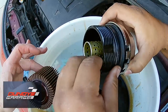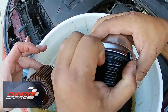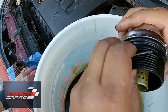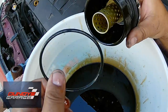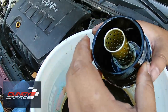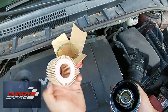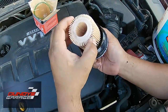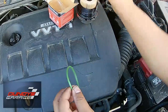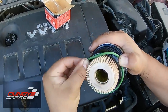What we'd call that spring-loaded piece — I want to say anti-drain back valve. I kept telling him to get a little screwdriver in there to grab that O-ring, but he squeezed it together and was able to pull it off — kind of like squeezing a zit. He dropped it in the bucket. Looking at the filter, the brand was Micro Guard, which is O'Reilly Auto Parts. The replacement O-ring was green instead of black, which is nice because now you can see where it's at.